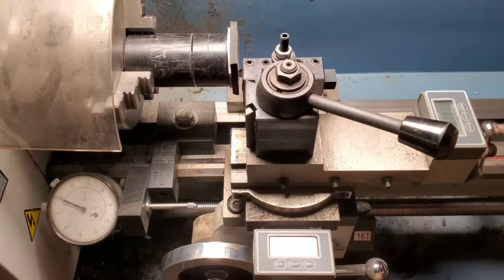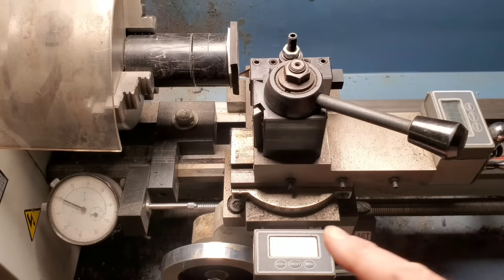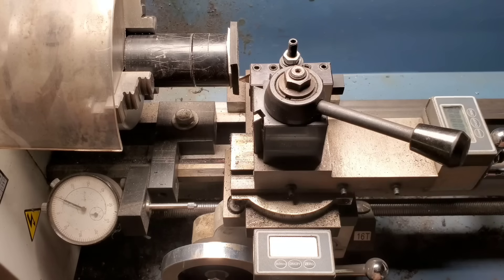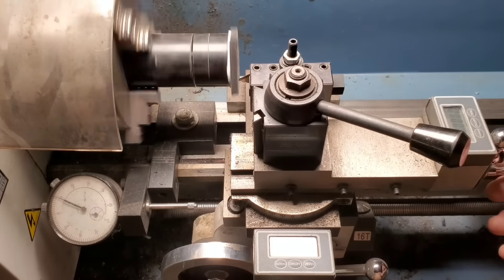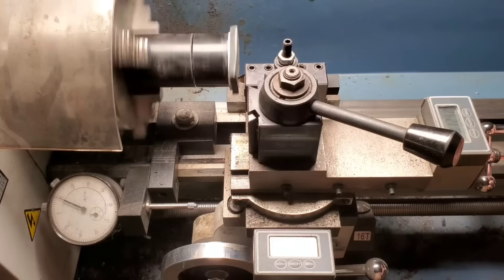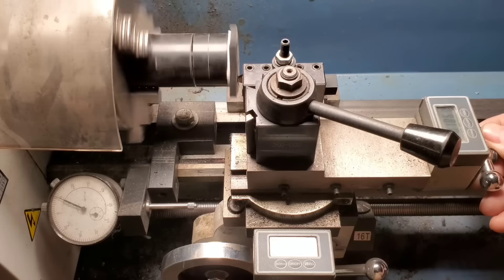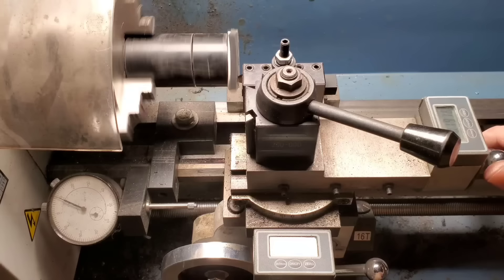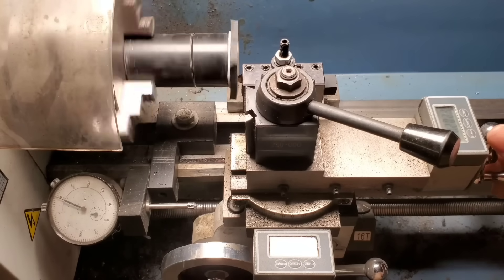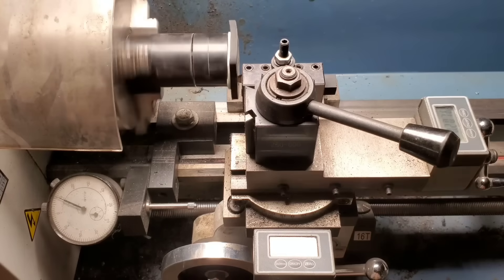We turn the machine off and back it out to zero again. We want a 1.4-inch outside diameter, so the radius needs to be 700 thousandths. We'll cut the outside diameter of the flat washer. Again, we're going to go in about 3/16ths, paying attention to this axis. So it's 182, then 187 right there, and then we'll go about 10 to 20 thousandths in further — that'll be about 207. We'll cut the machine off.